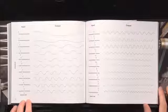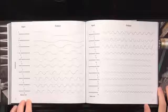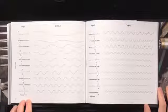These are cosines, each of a single frequency ranging from cosine of 1x to cosine of 20x. If you look closely, you'll notice that all the amplitudes of each cosine are not exact. This could be caused by the springs wearing out and having different spring constants, but a much more likely cause is different friction between the pen and the paper.